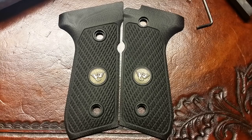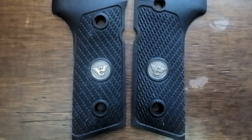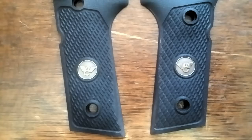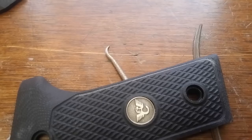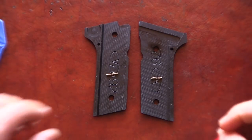Here's a look at the original grips and how they looked before the modification. I flipped them over and measured the thinnest area between the shoulder and the area where the beaver tail starts, then I marked parallel lines to the shoulder. Then I cut them off using a hacksaw and filed them straight at the rear — you can see that edge — and then I beveled them, removing some of the checkering, just trying to make sure they follow the shape. Then I used that diamond needle file to cut the new border in — you can see that new border — and then I repaired the checkering that I removed when filing.